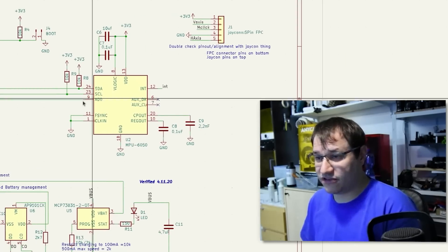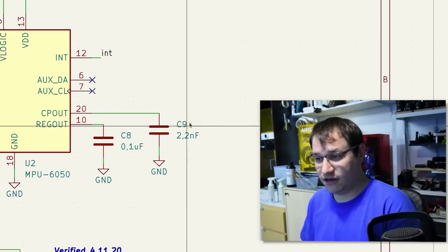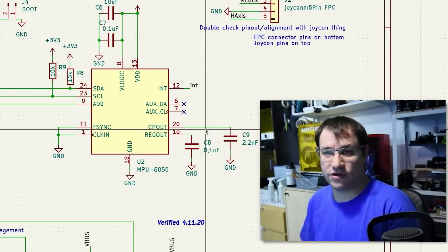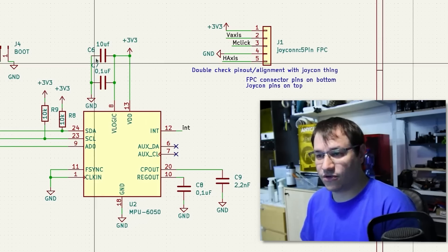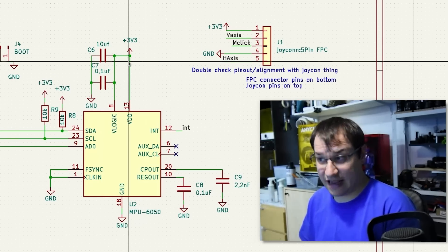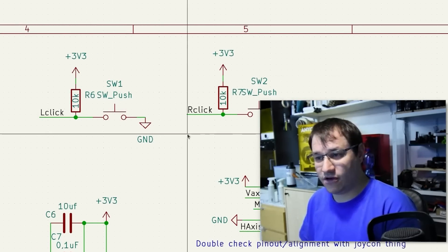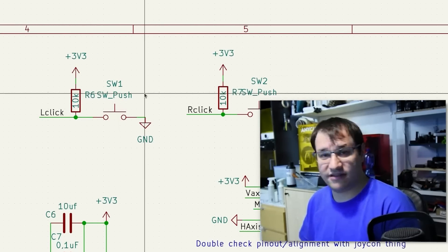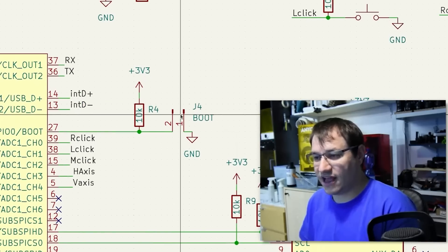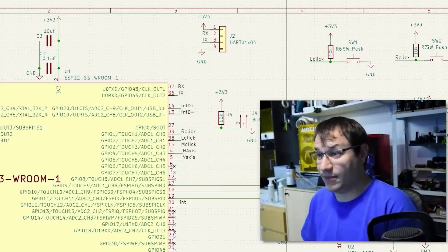It's pretty simple to set up. It's really important that you have the right capacitor values, especially the 2.2 nF — that turns out to be crucial. If that is wrong, the readings aren't right. Also make sure you have the coupling caps on there so your voltage source is really stable. I have two buttons on here with pull-ups so I can be sure the button state is not some floating value. This little header lets me put the device in download mode so I can easily program it.